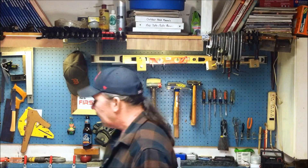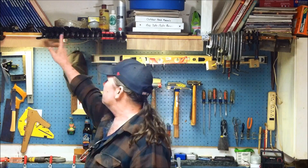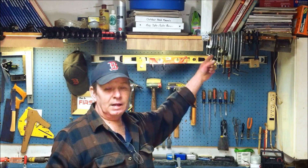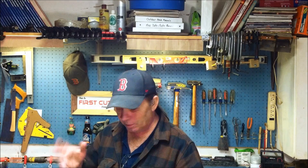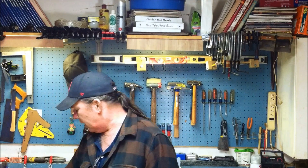More clamping solutions. I have a dozen spring clamps above my workbench, five small ones, five others, plus a variety of C-clamps. But this happens to everybody — have you ever been doing a glue-up and you find out you're one clamp shy of what you need, and you don't realize it until after you've already got glue together and wood stacked up? It's happened to me more than once, which is why I now have a dozen of those. Rather than bringing in a big F-style clamp for a minor squeeze-up, there's a quick solution you can use in a pinch.